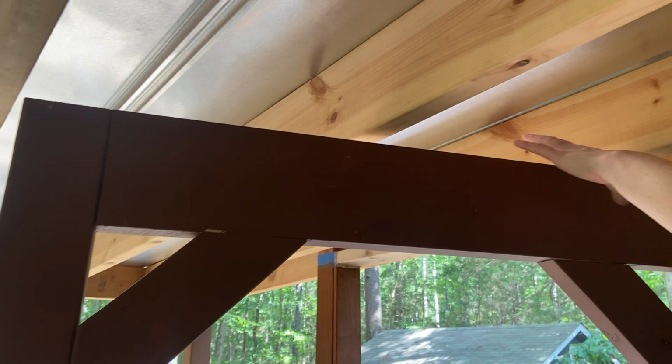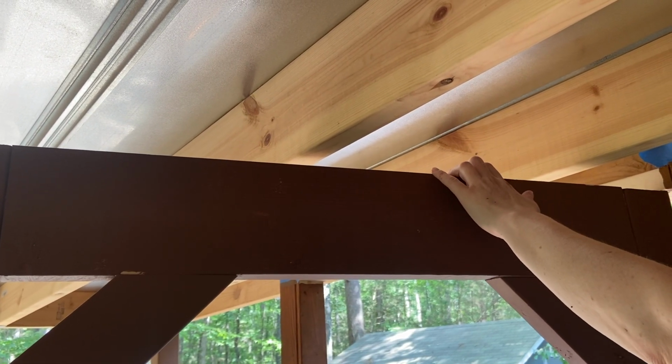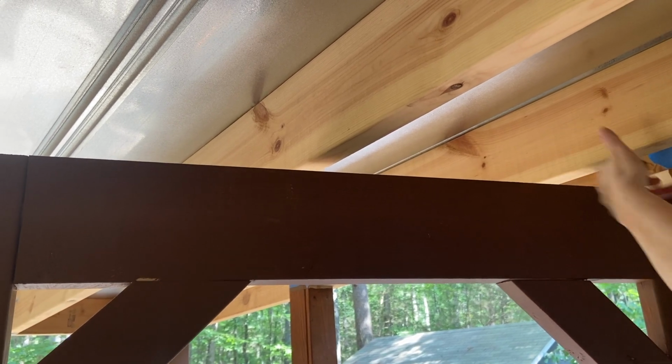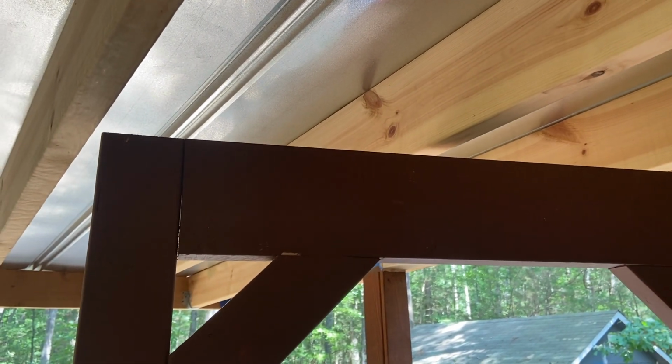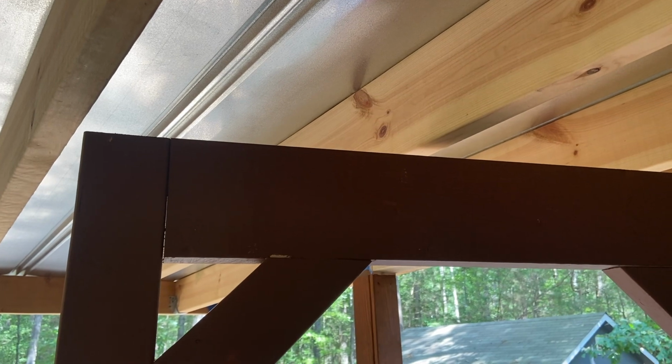So we're gonna paint the top of the door as well, and the reason is for waterproofing, to protect it from any sort of dampness or rain or anything that could come in from the side, rather than looks. Obviously you can't see up there, but we want to continue to protect the door and not let the water come in from the top and rot it all the way through.